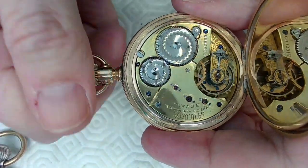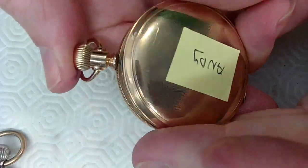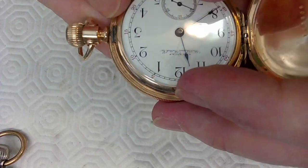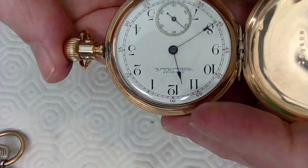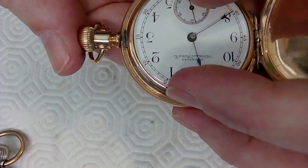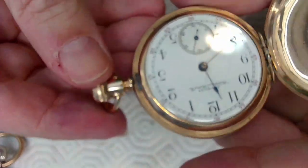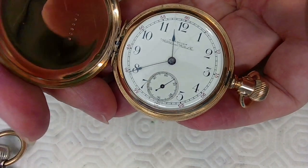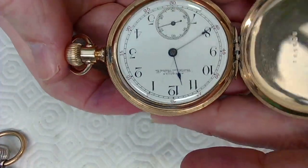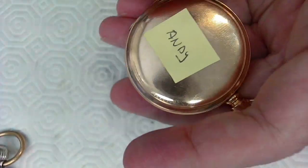Hopefully that'll come next week from the UK, and we'll try to fit that and see what happens. There may be the situation where no crystal will work, because as I looked at that other crystal, this one here, sitting on top nicely, it's just sitting there right now. It does sit there. I don't want to glue this in place, although I'm tempted to. But I know damn well that the diameter is wider this way than this way. And I don't know why, because it shouldn't be like that. But anyway, your watch is done and in beautiful condition and working really well. And I did a lot of work on that balance and had some fun. Anyway, there you go. Let me close this down and go back to my other scene.